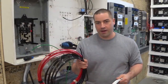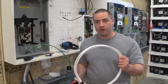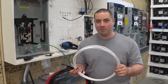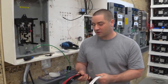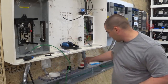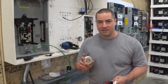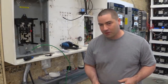The black and red are going to be the two hot legs. The white wire is going to be the neutral, but I don't think I had enough — I took all the rest that Home Depot had and they were at the end of the spool with no spares. So I think I'm going to have to use a piece of black wire and tape it up. I've got some white tape, so I'll tape the ends. We'll take it apart and see if we've got enough to pull it off.